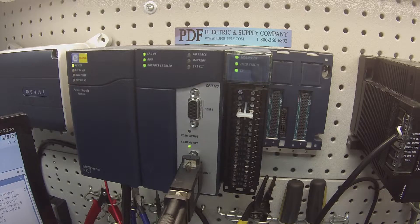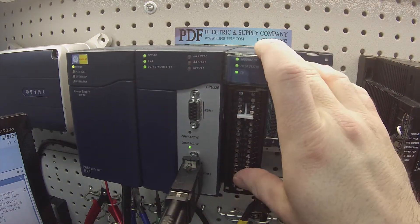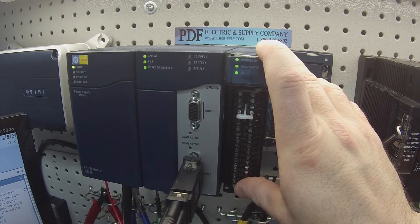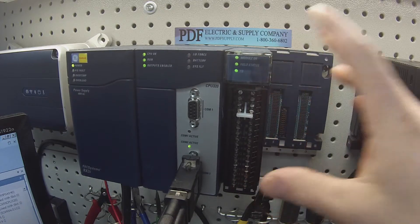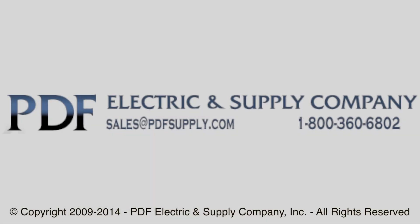If you follow this test and check all your channels and they're both stable and have range and resolution, then it's a very good working unit. If at the beginning of this video you're unable to get a module OK light, or if any channels are unstable, fluctuate greatly, or fail at full value as I described, you have an analog input card that needs repair or replacement. We do repair these ALG112s here at PDF Supply — we offer exchange programs, new and re-manufactured products, and same-day shipping. Please see us at PDFsupply.com. Thank you, I'll see you next time.